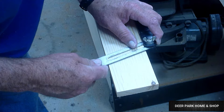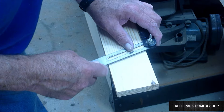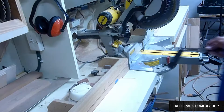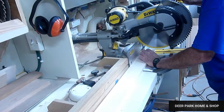This tool is called a bevel gauge. These are sold in most tool stores and lumber yards. Loosen the screw and hold the wood handle tightly against the side of your board, then set the blade right on your angled mark and re-tighten the screw. Move the gauge down the board and line up slightly above the bottom corner, then make your mark. Now we've successfully transferred the angle and we can go cut it. Before putting the bevel gauge away, use it to set up the angle cut and lock your saw into place to match the gauge. If you're using a table saw you can set your miter gauge up the same way. Remember, we only want to cut one of our sides for now.